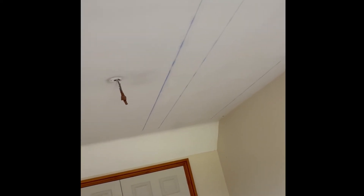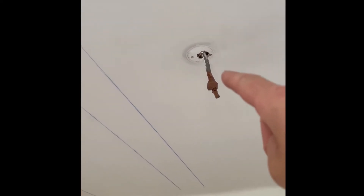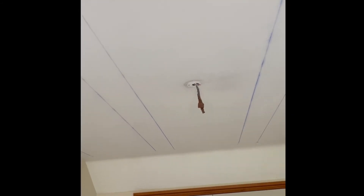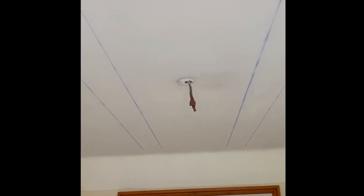The next stage is the plasterer. He will bed each track, so I've lined out each track because I've heard stories that plasterers, when plastering, can push the mat off track. If you've got several in a room — this one has only got three tracks — you'll run out of room and it won't fit. So I've chalked a line exactly as a guide to keep them in and keep them straight. Every light fitting and smoke alarm on the ceiling has got to come down, and you can cut the matting to allow for this using a sharp Stanley blade — I believe you can cut a hole of about 75mm diameter.